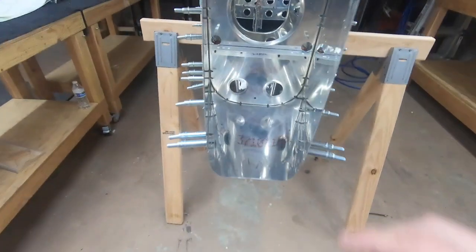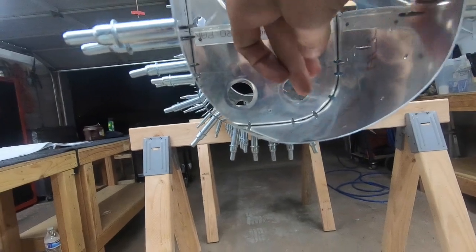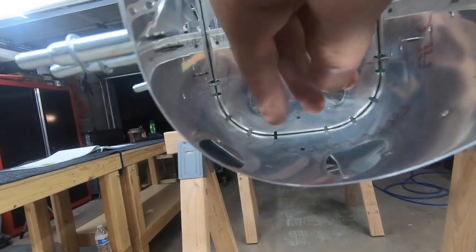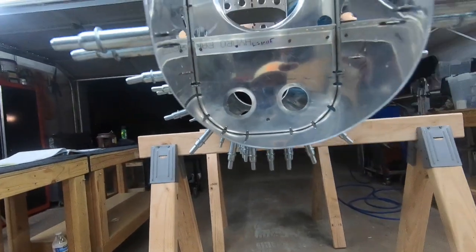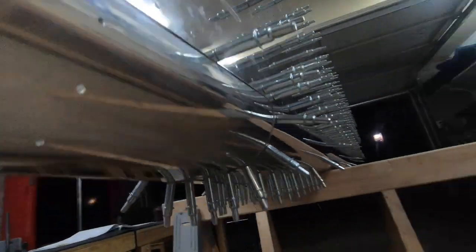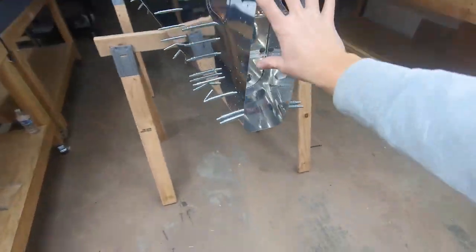That worked way better than expected. These angles now have far less of a gap. Previously I used a crescent wrench to bend the back side of the tab, but then realized the front end was not bending to match because of that hard bend from when they bent the bulkhead. Using the Scotchbrite wheel and being real careful not to go too far and make a knife edge — just lightly hitting each of those corners — worked amazingly well. The Clicos went in without really any fuss. That's really good to know, especially when it comes to riveting later after dimpling.